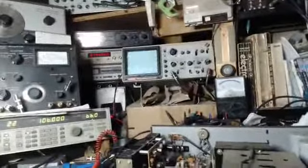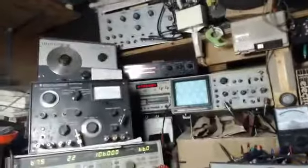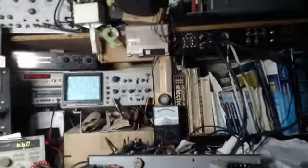So we're going to bring this back. Notice the oscilloscope is changing as I change the volume. Let's bring it back to about there. All right. Now we're back to the dummy loads. And I'm going to change this light a little bit too. Okay, so we're in the auxiliary input, and what we're viewing on the scope is exactly what we should see. There should be very little variance, and if you look at the bar graph up here, there's maybe a 1 or 2 decibel variance, which is within specifications, especially on an item this age.